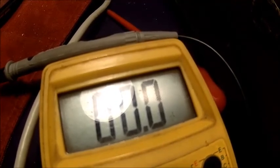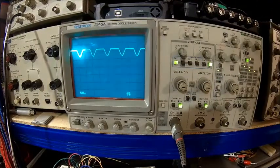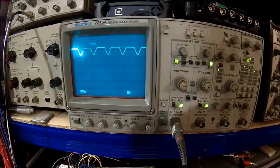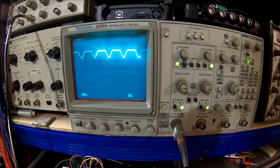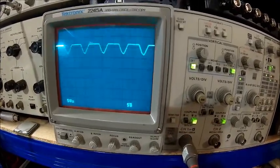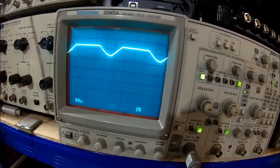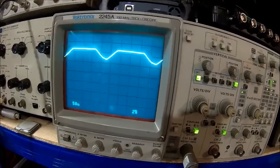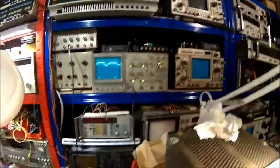It's quite possible there's a lot of ripple on it. Let me hook up a probe with a scope and see what comes out of that. That's 50 volts per division - so that's one hundred and a bit, and that's how it looks. We're getting 50, 100, 100 and a bit with a massive ripple on it. The ripple is at least 50 volts.